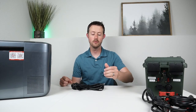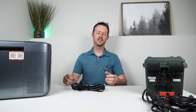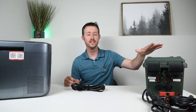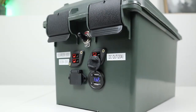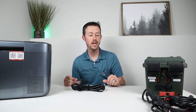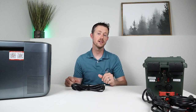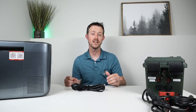So there are two different tutorials on how to modify your fridge cable to use a 5521 barrel connection - probably the most common connection you get on a power station. There are a ton of other options, especially if you're doing a DIY setup. For example, here I have my DIY 50-amp-hour power station and I used Anderson PowerPole connections on the front. You could also use SAE. What I want to do in the rest of the video is show you some of the cables and adapters I've made, because if you learn to make your own custom cables, you can save a ton of money.